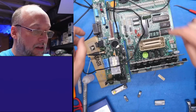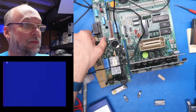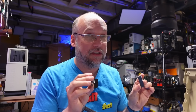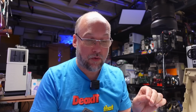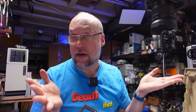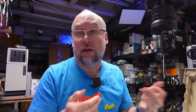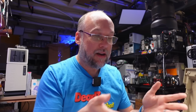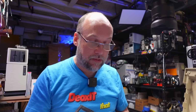All right, Pokey's back in, 6520 is back in. I'm assuming we should get a prompt. We do. I learned some great troubleshooting tips here. Now, the question I have is, was it already common knowledge that you could take out the Pokey and the 6520 and the floating point ROM and still have a working system? Maybe. I didn't really see anything about the minimum viable configuration for the Atari and what you could kind of do without just to eliminate those as potential problems.